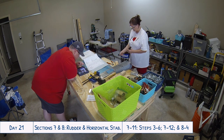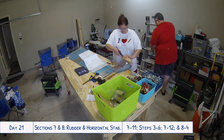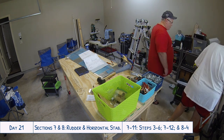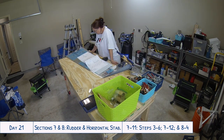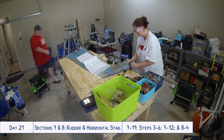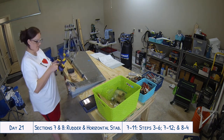You get the wood clamped to the back side and then hammer another piece of wood on the front to get the final bend into place. This was pretty easy going straight by the book and manageable as one person. The key thing — and the book mentions this — is to provide some resistance on the back of the wood so you don't crimp the skin. We only want to bend the part at the front; you don't want to accidentally put a kink in the back because the back piece can push against the already-riveted skin when you hammer the front. Just put a little pressure with your hand on the back of the wood while hammering the front.